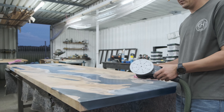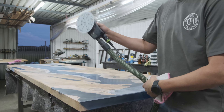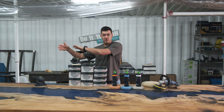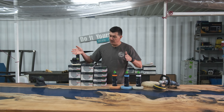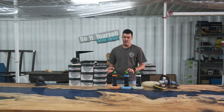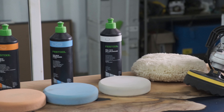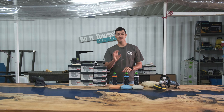From 800 grit onwards, we sand for 20 to 30 seconds, lift the sander, and just use a normal cloth to wipe the dust off. When you sand one side the sander makes the epoxy show a white powder dust confirming you've sanded that section. We wipe the table clean with the cloth and then sand again. Once you are done sanding, we move to the polishing stage of our epoxy table.